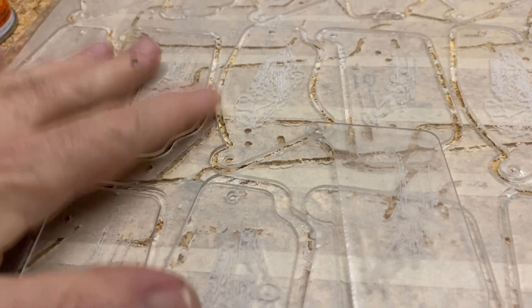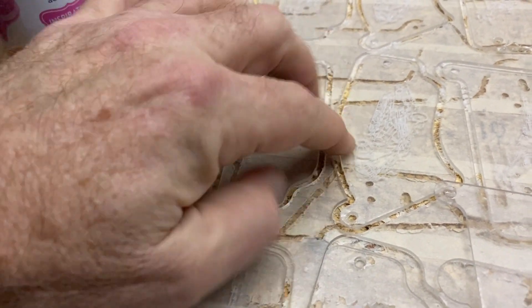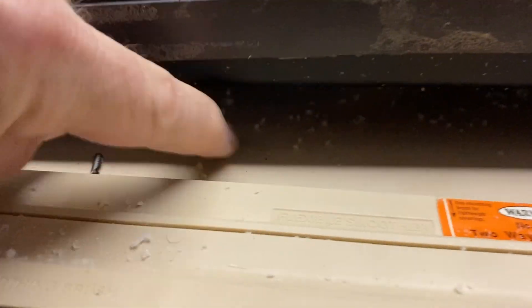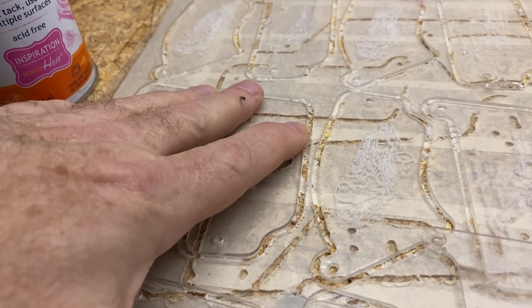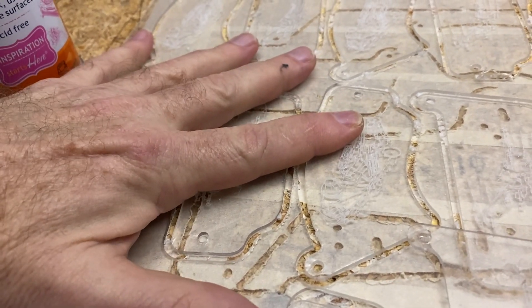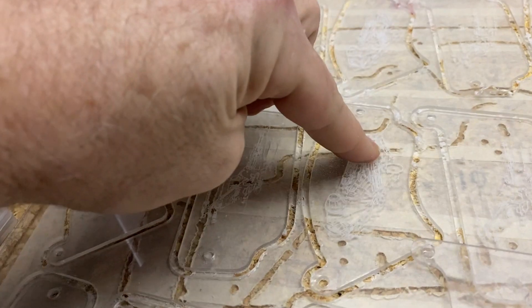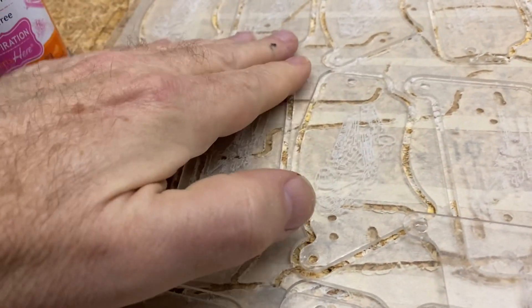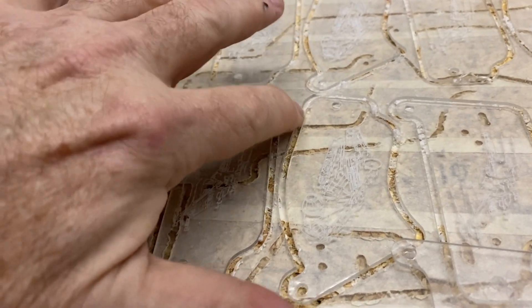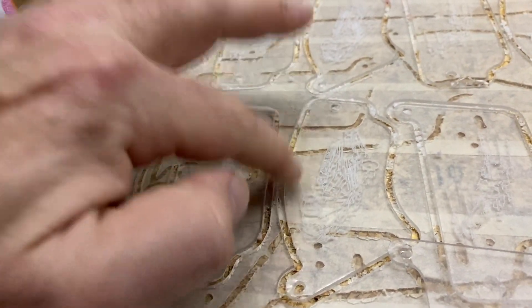While I'm running it with protective gloves on, you cannot leave this for a second. I hold the plastic down around the outside of the cut. As it goes around I feel for vibration with my hand and press down, trying not to press the board itself down — there is some flex in the board if I press too hard. After the bit has gone by I put my hand in behind it and hold both sides so there can't be any moving. It's most important on the last pass, when it's cut through in one area, to hold down the area already cut through to prevent any movement or vibration.